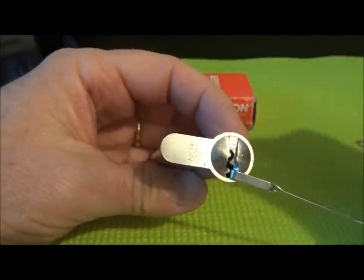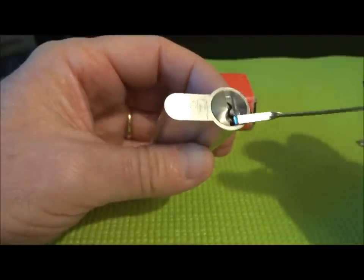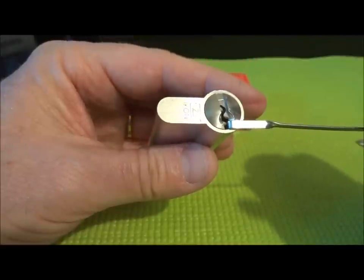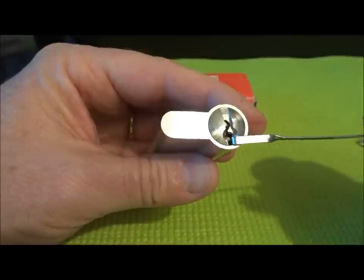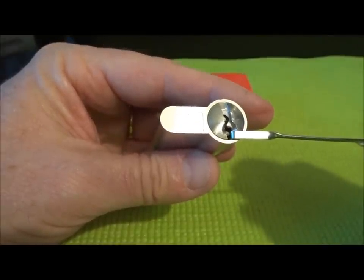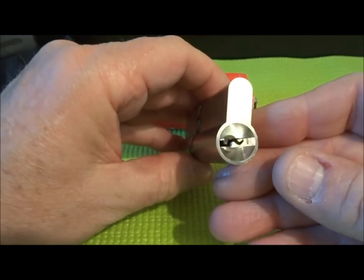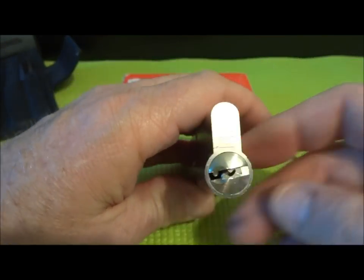It isn't as hard as you might think, but because of the extreme precision in the manufacture of these, you really have to be careful with that tension. Pay attention to that tension finger more than you usually do, because the amount of feedback you're going to get is not as great as what we're used to in some of the less precise locks. But once you figure out that feel, and once you clear the normal pins from the shear line and get used to that reduced amount of feel, I think you're going to be picking these Zeiss Icons very, very quickly. Anyway, thanks for your time. Everybody stay safe, and from here in Brazzaville, Congo, I'll see you later. Stay legal, guys. Bye.